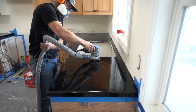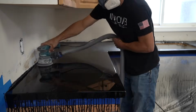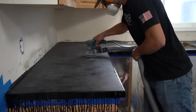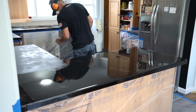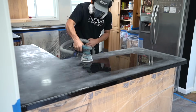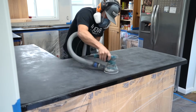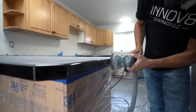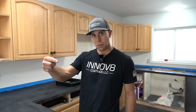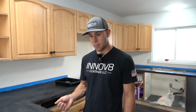So I sanded everything, used a 220 grit palm sander. We sanded the surface, got any sediment that might have fallen in it overnight, which this was really clean, but I always like to sand anyways. It just makes them turn out so much better, especially since we are doing matte on this. If for some reason the roller missed a little spot, or you might normally see a little stipple with the roller, that will hide really well since we sanded it, by going over it with matte.